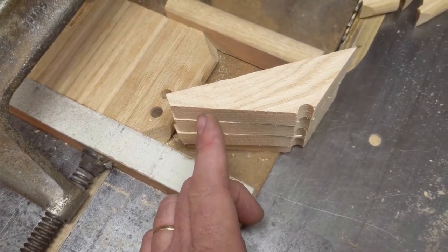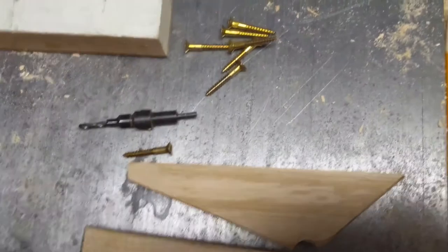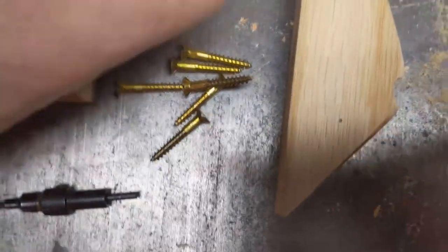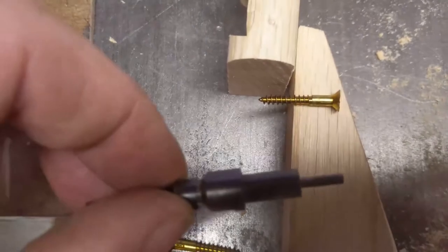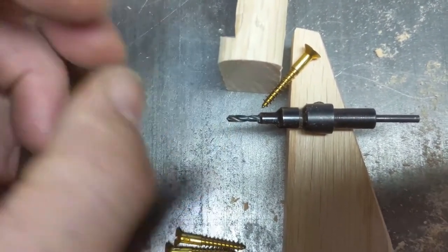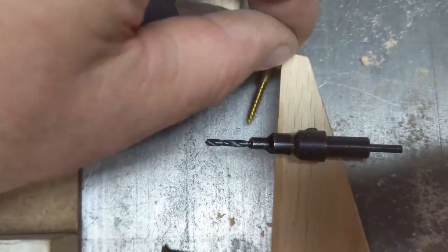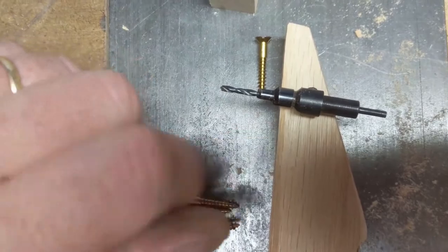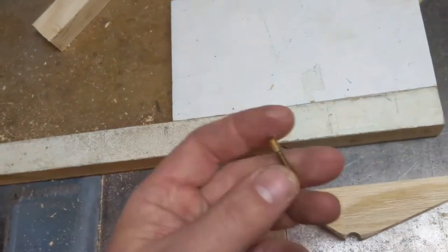All we have to do now is drill and countersink these and glue them to the bottom of each step. Where possible, I'll be using traditional joinery methods and hardware. I have these number six brass wood screws — I might prefer a number eight if I had it, but these will definitely do the job. The glue really does most of the work. In order to get the hole drilled just right, we'll be using this number six countersink. The actual thread-gripping hole is adjustable length. The upper part of the countersink will make room both for the shaft of the screw and the beveled head of the screw, all in a single operation — making a nice, perfectly stepped hole for this screw.